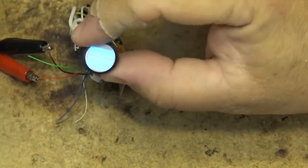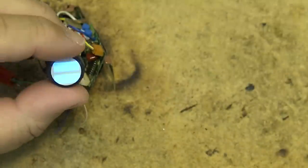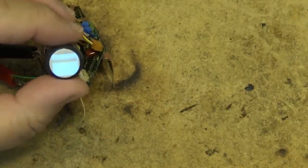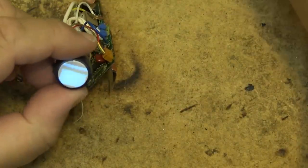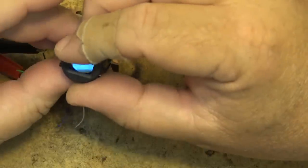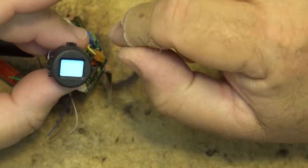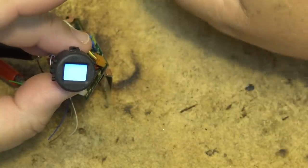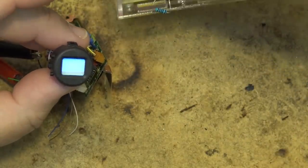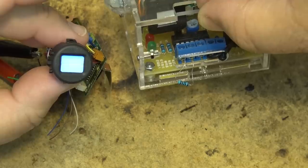Connecting the red and black to 5 volts — that's what it's going to require — and you can see we have a raster. The first thing you'll notice is that the edges are kind of cut off. When they put the mask on here you want to make sure you're not going to see any black, so the picture is actually cropped by this mask that fits over the tube.